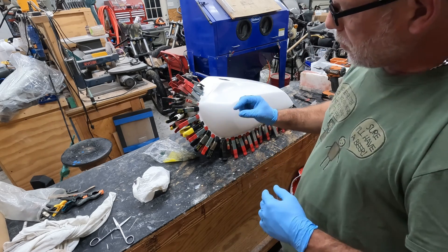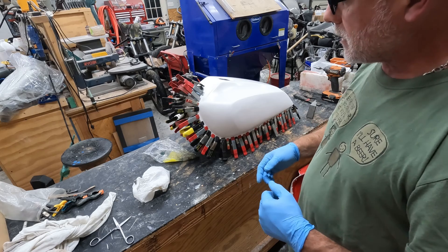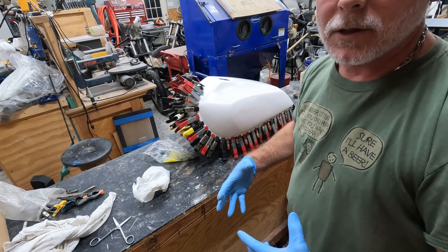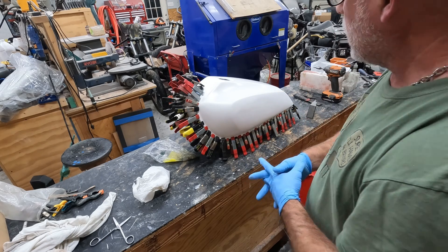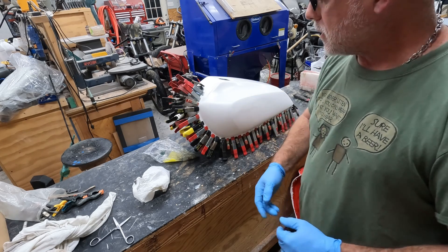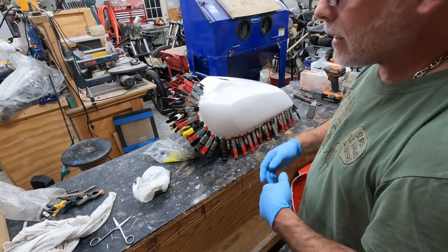I want the putty to sag down into the seams and create a really good seal all the way around. We have approximately 12 millimeters of sealing flange all the way around the tank, which is a really good sealing surface. The angles make the tank really strong — lighter than a steel tank but still extraordinarily strong. Once it's all cured and cleaned up, we'll sand the clamping flange with the belt sander, then treat the internal side, and the tank will be done.